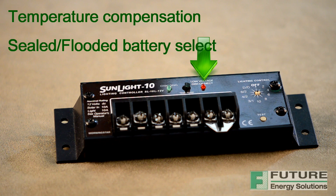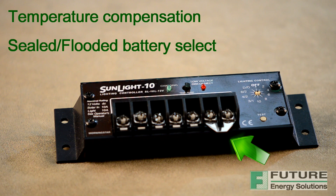The Sunlight controller also features a sealed or flooded battery select. It is shipped with a jumper, which is installed between the light negative terminal connection (connection number 5) and the sealed or flooded select terminal. With this jumper installed, the Sunlight is configured for charging sealed batteries. If your PV system has a flooded battery, simply remove the jumper to change the Sunlight to a flooded battery charger. You can switch between sealed and flooded as many times as you wish using the jumper, or save it in case your battery type changes. If the jumper is lost, a wire can also be used.